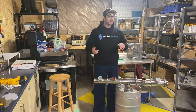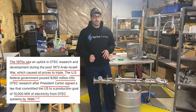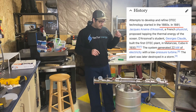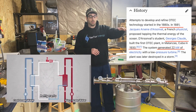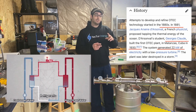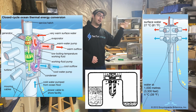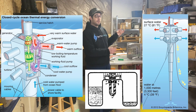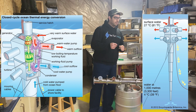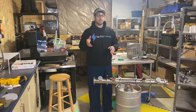There haven't been too many of these plants and the concept has been shelved by many countries. Even in the US there was a significant government-funded initiative for it. To give a brief history: D'Arsonval, one of Tesla's friends, came up with the idea of using the temperature gradient between warm surface ocean water and deep ocean water for generating power, using a low-pressure chamber to boil a motive fluid and condense it on the other side of the turbine with cold deep water. He came up with this in the 1880s.